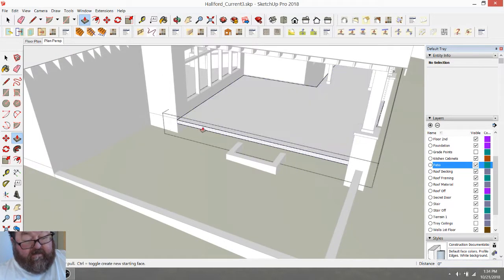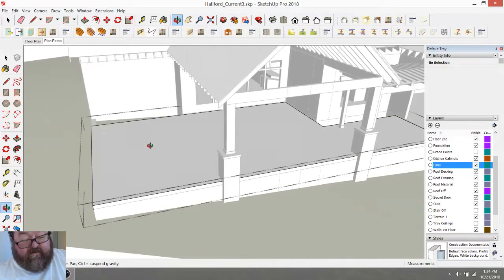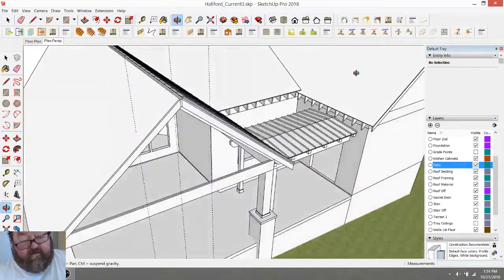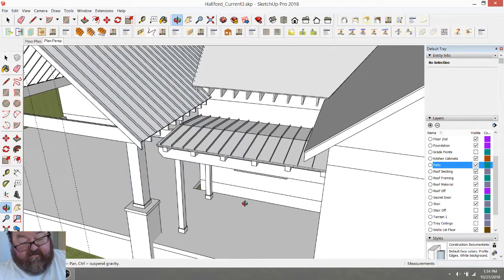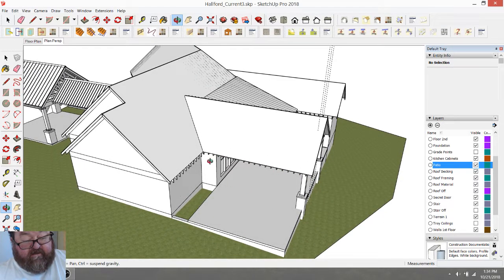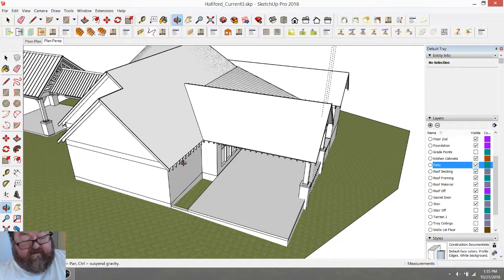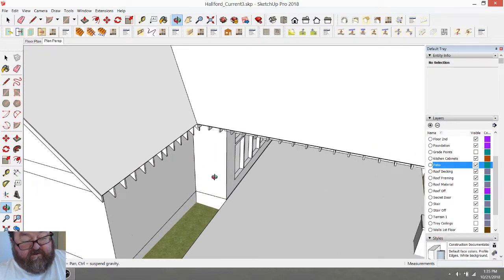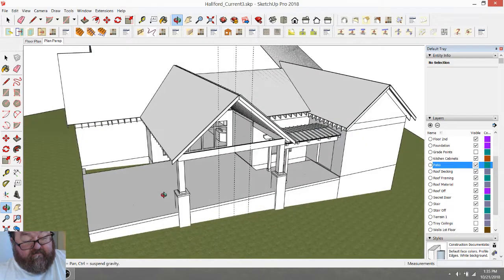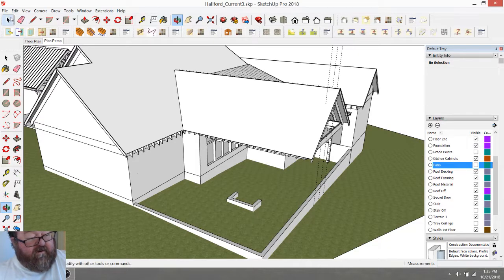If it was me in my house, I would just bring this over to here, but I would leave a landscaping border there like I did over here. This would be plants. You don't want to plaster your entire yard with concrete. I wouldn't. And also, you're going to need a downspout in this corner somewhere. You don't want to run this big L without a downspout, and that gives you a way to run your drains. This could be pea gravel or whatever, and you could have shrubs here, like that. Now let's turn off our patio for a second, and we'll bring our fireplace back up.